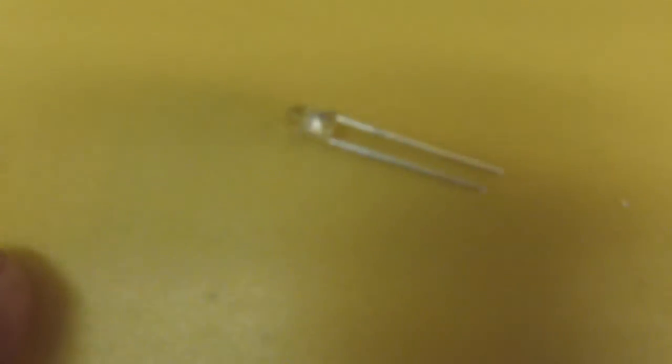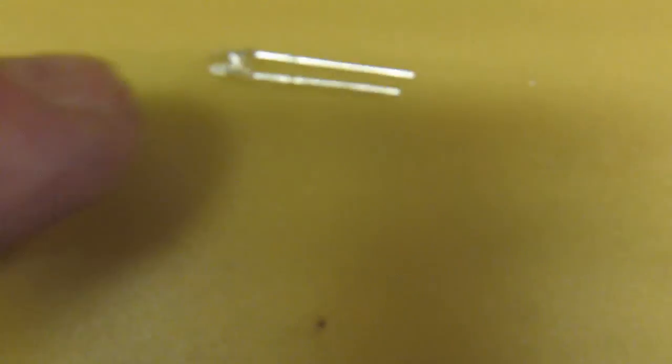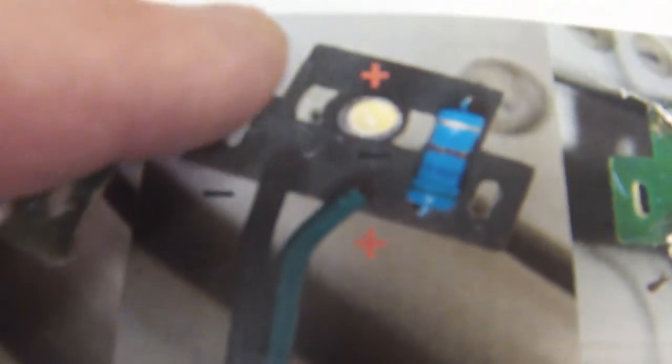That's the old LED and the old resistor out, and you can see the holes they've come out of - quite a quick job. Something to remember is putting them in around the correct way. Simon has actually shown this on the diagram, but to quickly go through it: the long leg of the LED is the positive and the short leg is the negative. The resistor can go either way around, so don't worry too much about that. Looking at the board, make sure it corresponds - the black is negative, the green is positive - so all you need to do is lay this on top of the diagram and copy it.